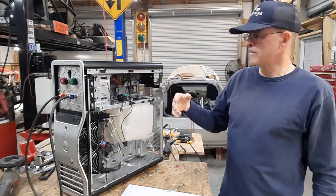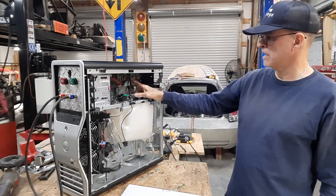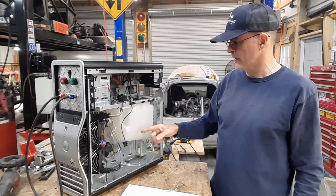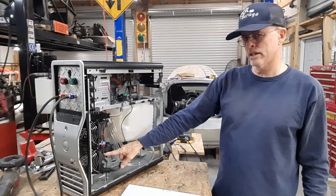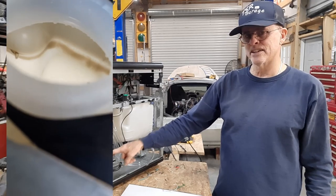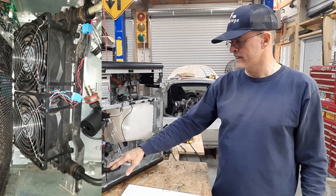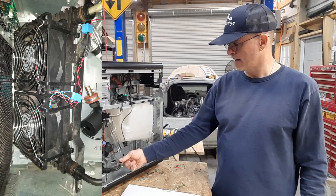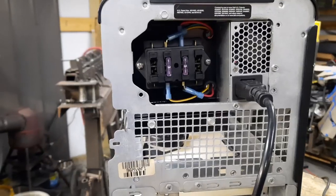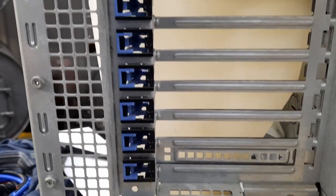Everything came off eBay or Amazon — links in the description below. The fans, power supply — they all were parts I had or came out of this computer or another computer. The cooler, chiller, radiator is a trans cooler. Make sure you clean those out real good because I had to clean the whole system out because I didn't clean it out well enough. It's a trans cooler off a 2004 or 2005 Chevy truck, but any of them will work, and all of it is three-eighths hose. You have to stretch the hose a little to get it over this one, and all the bay doors and card slot doors were removed so you can see the fluid level in the tank inside.